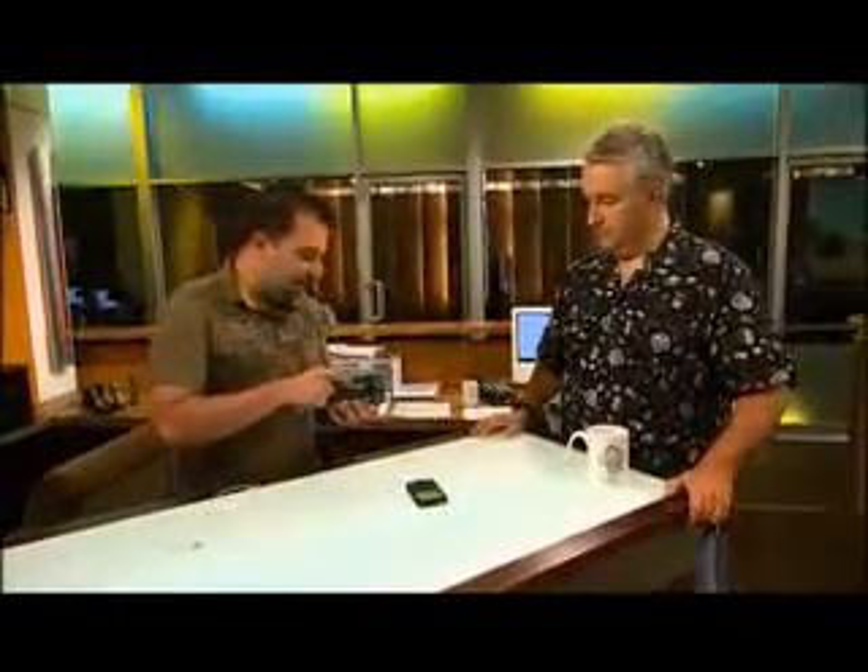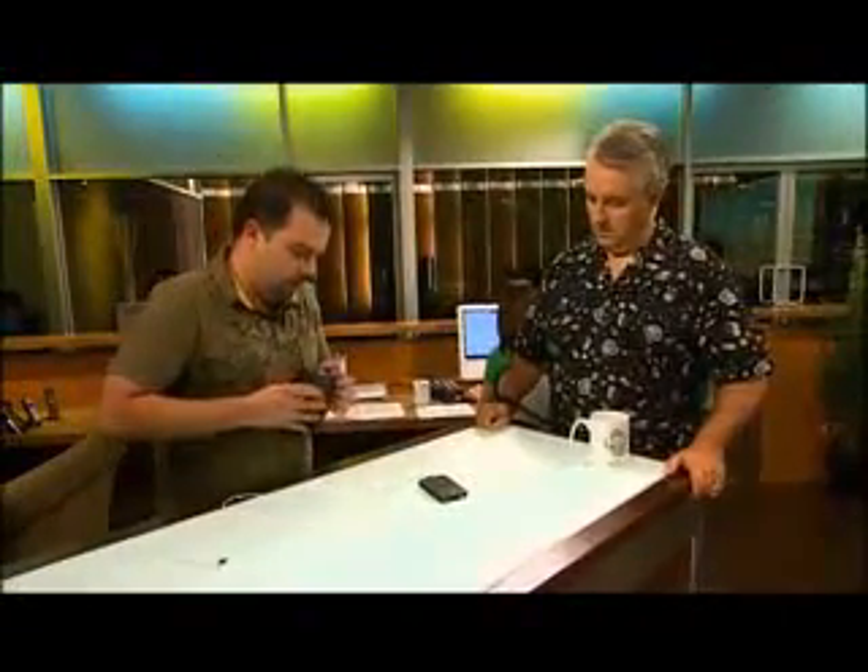Now, if you want to do this at home, it's actually quite simple. You need to make sure one of the prerequisites is an alarm clock with a power supply anywhere between 9 volts to 12 volts DC. Is there a way to know that? Not beforehand. Some of the more expensive models might say, but most of them don't. Most of them, usually if it contains a battery backup device, it's 9 volts DC — because that's how the backup unit works.